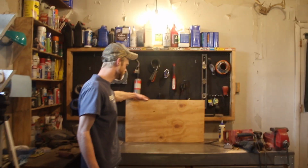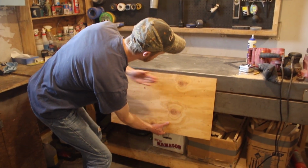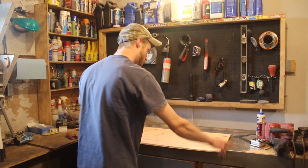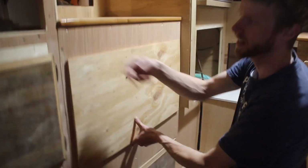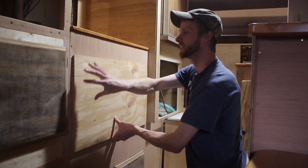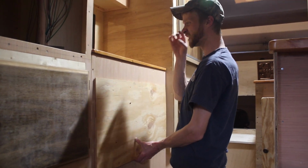We have the warped plywood, and it's 1/2-inch plywood, and I want to try and use it to budget build. When I put it up against the wall, it had a nice bow to it, and it wasn't that great. So my plan was to just sand it down with the belt sander here on the edges so that it compressed better, or it wasn't as big of a gap. I'll show you. It's going to go here, and it's going to go like that. I just sanded on those back sides of the corners, so now there's less of a gap right here. There was like a 1/2-inch gap where this thing bowed out. Now that I sanded the corners, it's much closer, and it really doesn't look that bad. You can tell it's bowed, but the only other material I had was 3/4 inch